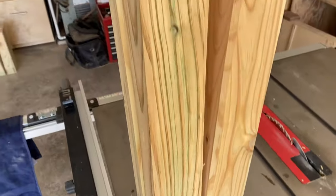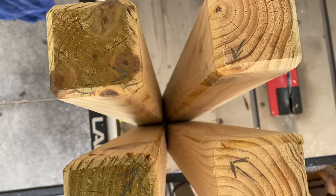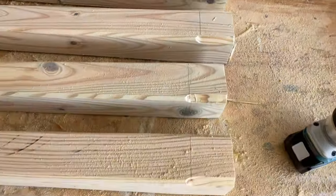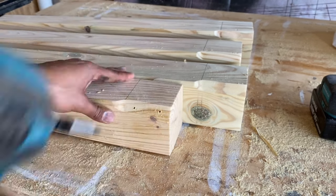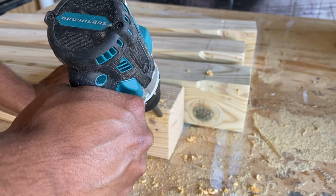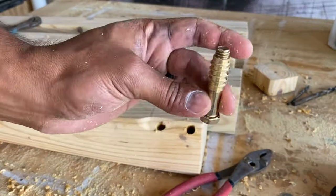Even though our taper was subtle, when the legs are all stacked you can see it looks pretty clean. I got each set of legs stacked up so I could mark the inside corner, so at assembly I wouldn't get confused on where each leg went. Once I had that figured out, I started pre-drilling for those threaded inserts. I used three-eighths inserts and sunk these in with a little bit of CA glue and a bottomed-out bolt in the threaded insert itself — pretty straightforward.